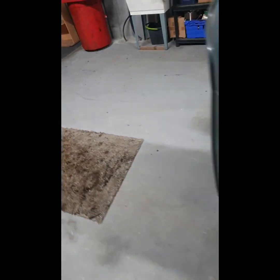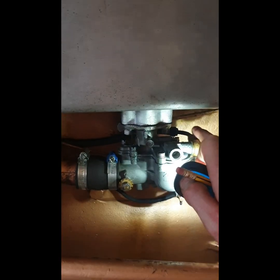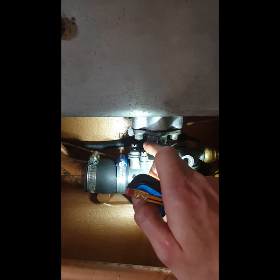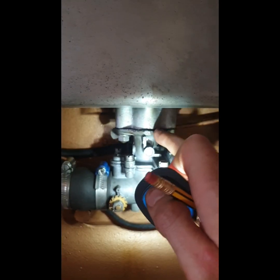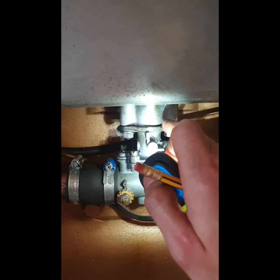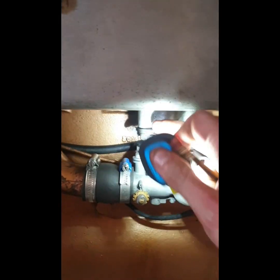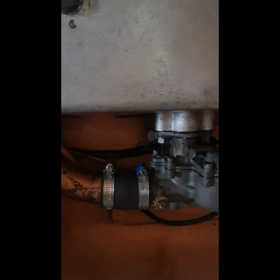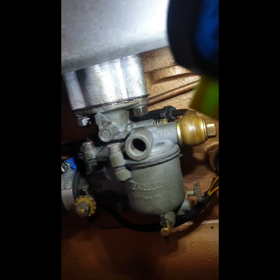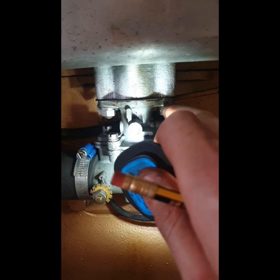So I also noticed yesterday that I should probably put spring washers on these, because these keep needing to be tightened up. And I did notice I was getting a lot of fuel hanging around there, and condensation and everything. So I wonder, is there still a bit on it? Actually, it still looks a bit wet there. It's hard to know now. Probably is. It's very hard to flatten that surface, for the simple reason being you have 2 studs and it's very hard to remove them.